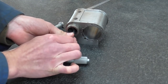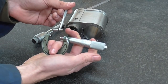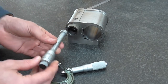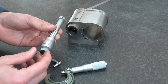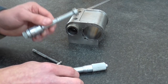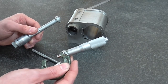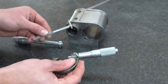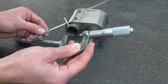I'm also comparing to the bore size, and I'm using the same micrometer to measure both ends of the component and the bore. To do this you naturally have to measure the bore with something compatible with your external micrometer — a telescopic bore gauge is a perfectly good solution. Set the bore gauge and then measure with your micrometer, comparing that number exactly to what you're getting on the lathe. A more accurate instrument like an internal bore mic would give better parallelism measurements, but then you're comparing the calibration of two different instruments. For your average machine shop, comparing the actual bore size to the actual measurements on the machine with the same micrometer is a good way to go.